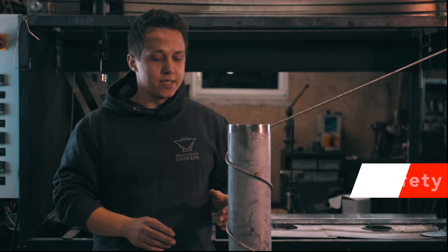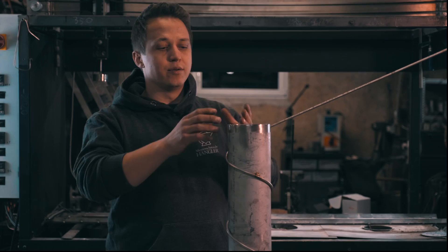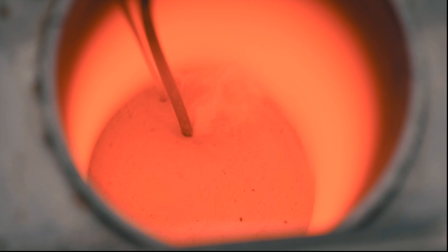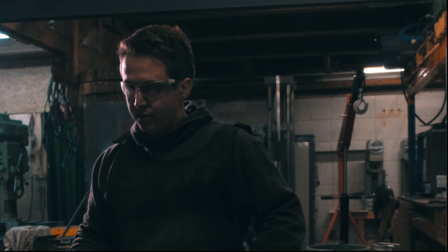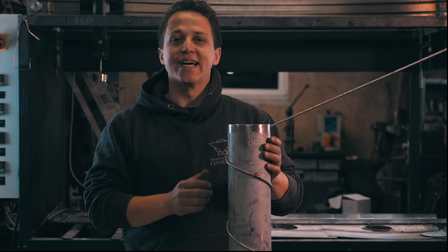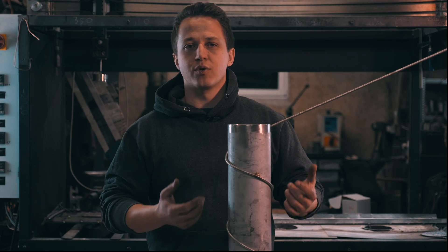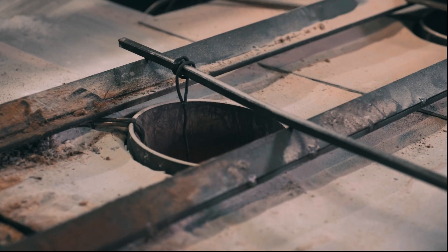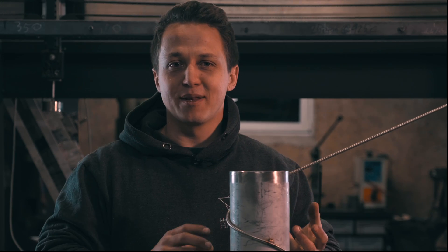What about safety and emissions? This system is a lot safer than salt baths. In my opinion, it is a very safe method to use. The only thing is sand coming out of the top a little bit, which is hot, which you have to be careful for. So I wear gloves around this machine and I always wear my goggles because I don't want to have five grains of 800-degree hot aluminum oxide in my eye. But other than that, it is very safe. You don't have any emissions in gas form. You will have some sand piling up around your system. You can use a funnel on top — there's a specific reason why I don't use a funnel, but that's probably not applicable to your system.